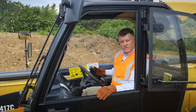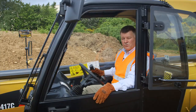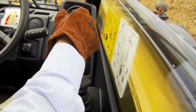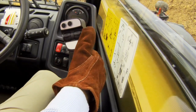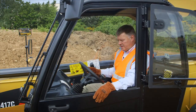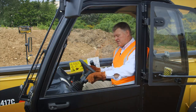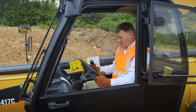The main controlling joystick controls the boom up and down, in and out, and the level of the forks. The joystick also controls the stabilizer legs — by pressing a button in at the front and pushing the joystick forward the stabilizer legs will go down; holding the button in and bringing the joystick back the stabilizer legs will come up. So very simple, logical, easy to use even for the most unskilled operators. Transmission is controlled by this lever — forward, neutral and reverse — and the gear change is simply one, two, three via a twist grip change to that power shift transmission.